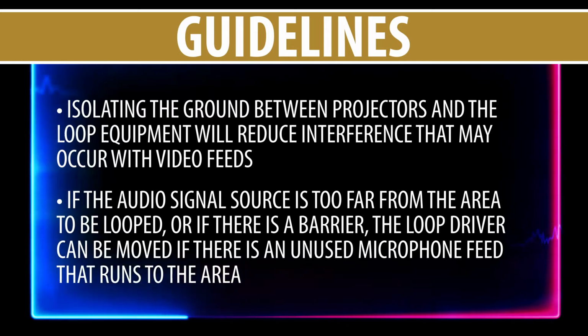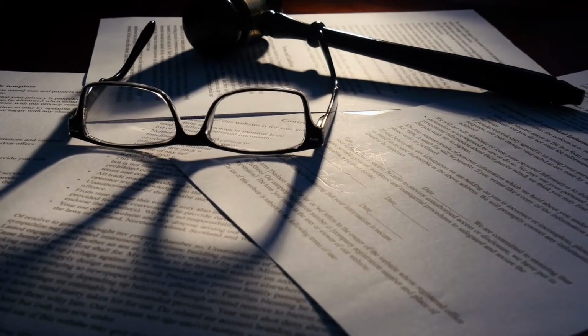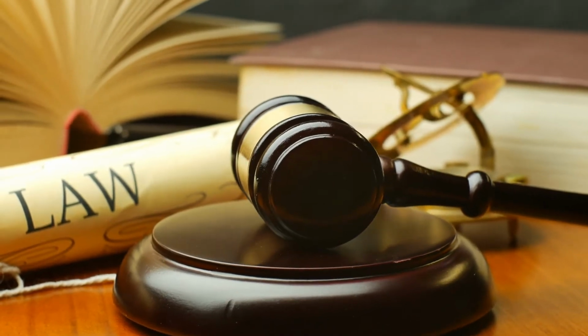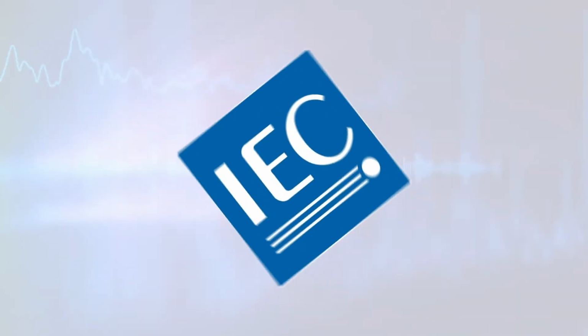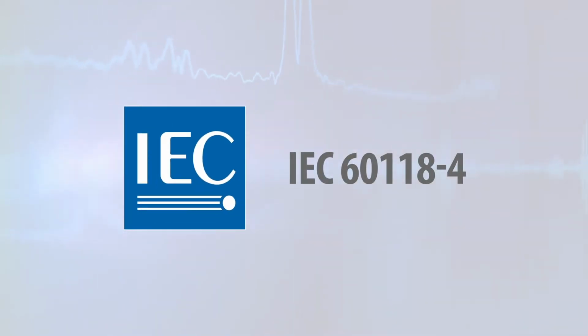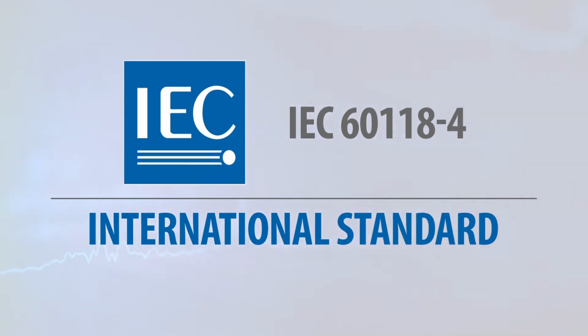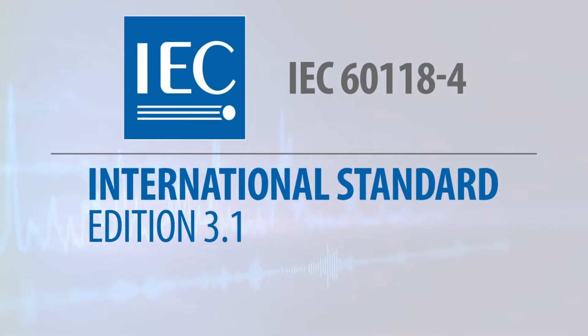Unless the facility or local authorities have written standards, there are no governing bodies for many hearing loop installations. Best practices suggest compliance with the latest revision of IEC 60118-4. In most areas, there is no code or law requiring adherence to the IEC standard, but most installers and experts regard it as the minimum standard for hearing loop installation.